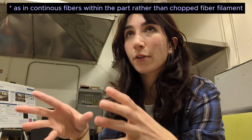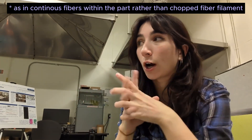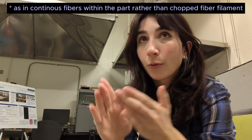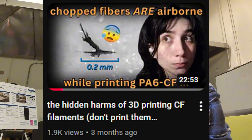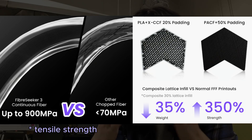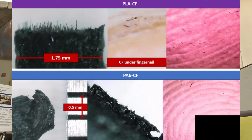CFF is actually wonderful from a safety perspective too. I posted a video about chopped carbon fiber filaments and how those fibers not only rub off on your skin but can become airborne when you print. CFF allows you to use a base material that isn't fiber filled, print with reinforcement fibers, and still get a strong final part. When you don't use a chopped reinforced filament on the surface, you won't have any fibers rub off on your fingers while handling the part, and no chopped fibers exist in the air while you print.